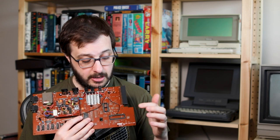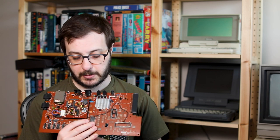That was the Z80 CPU heating up, and that pin becoming unstuck, stuck through thermal shock, I guess, I don't know. But that CPU was definitely bad and needed a replacement, so I popped my replacement working one in there, and then the system just started working perfectly, except none of the joysticks and the keyboard worked.